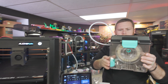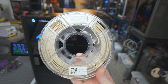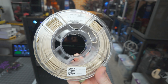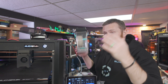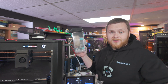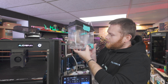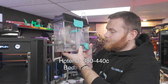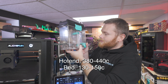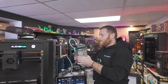How hot? Well, let me show you some filament they sent me — it's drying right now on my Polymaker dryer. Some of you guys might recognize this: this is an extremely expensive roll of PEEK. So why would they send me PEEK? Because this machine can handle printing PEEK in your home on a non-industrial-grade machine — and that, to me, is wild. That's why I wanted to say yes, send me the machine. No money exchanged hands; I can just do whatever I want with the machine as long as I showcase it. The minimum temperature needed to print PEEK is 380 degrees, going up to 440. The bed temperature needs to be 130 to 250°C, and the chamber has to be between 90 and 130°C. By those numbers, can your Ender-3 print that? No, I don't think so — so that's where this machine comes into play.